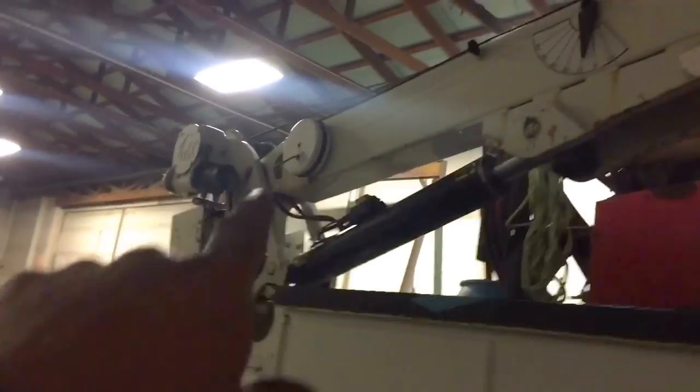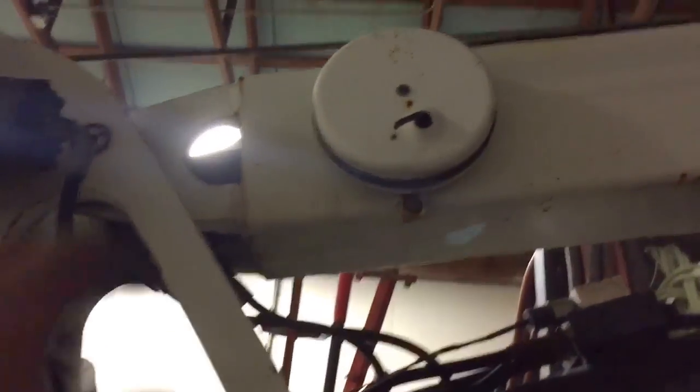I was going to work on my safety wire on my crane — I didn't get to it today. That's supposed to come out and go to a doodad. When you lift your crane up too high, it hits that rig and sends a signal back and shuts things off so your crane can't break the cable. That ain't hooked up right now.